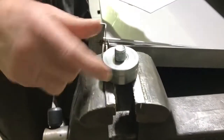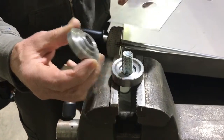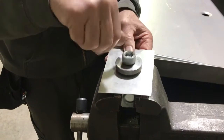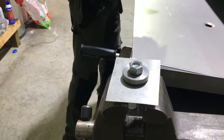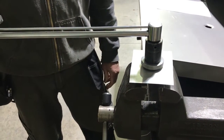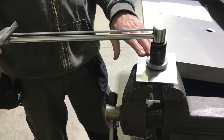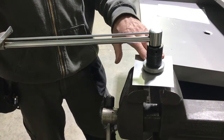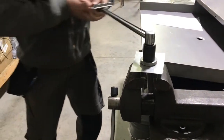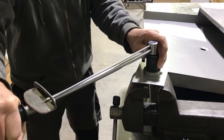Here is the Mod 2 design. You can see it has quite a bit less of an angle. I'm going to take this piece of 18 gauge aluminum and see how that works. I'm going to use a torque wrench on this — not because it's required, but I'd like to get an idea of what kind of torque it takes on aluminum. When it comes to a stop and doesn't feel like it's depressing anymore, we'll see what torque was required.